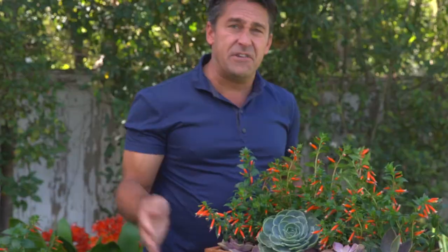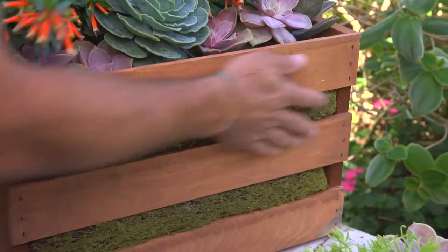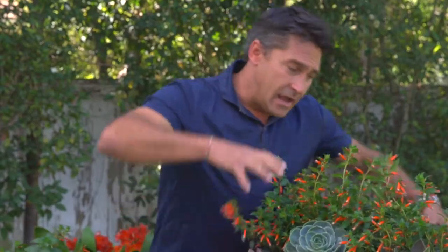I can finish this in a beautiful walnut stain, or I could get some white paint, milk it down so it's nice and milky, and then rub it over with a rag so it picks up the grain. That'll give it a completely different look — more of a Cape Cod style if you like.